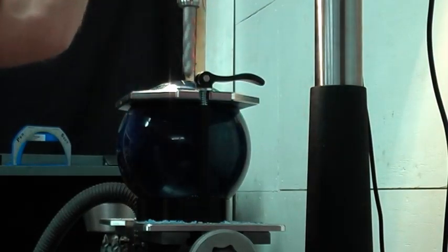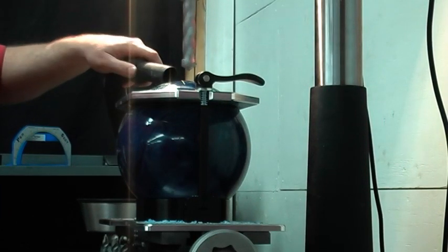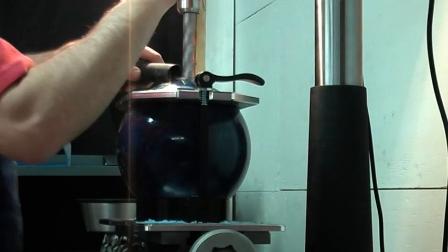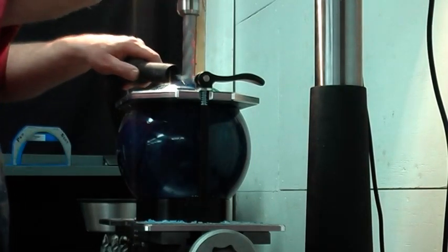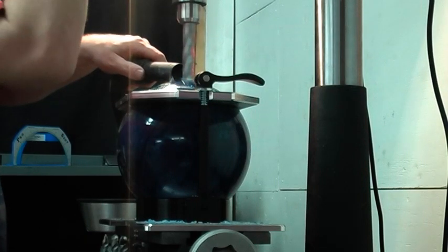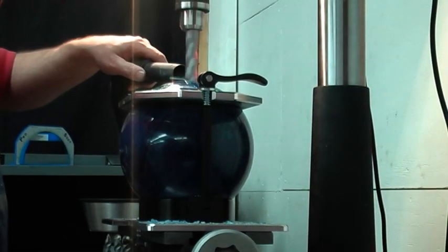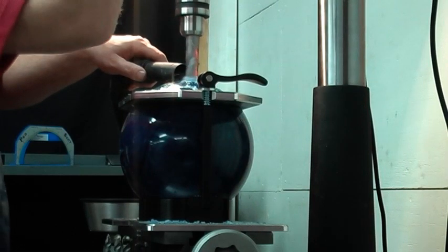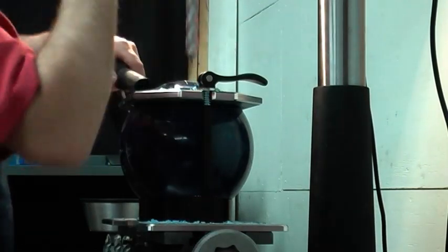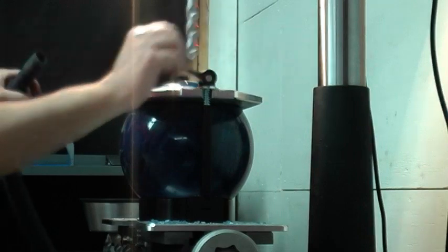Turn it on. Loosen it up. Hit the vacuum. Now again, I'm going to watch the bridge line first, and then the span line second, to make sure that I'm going to hit it. Okay, I hit the bridge line and the span line perfect. Again, I'm going to drill to a depth of 2 inches. Some people go 1.5 inches, 1 3/4. Like I said, it's all acceptable. Just go with whatever you want.